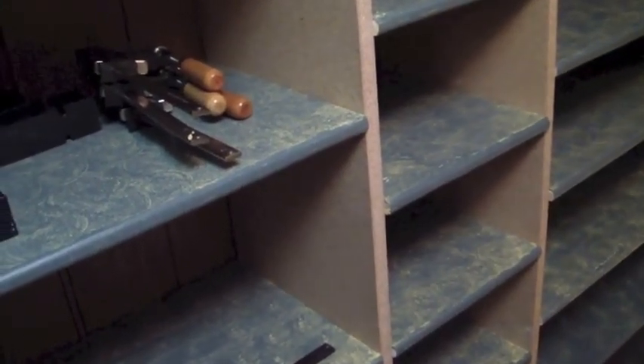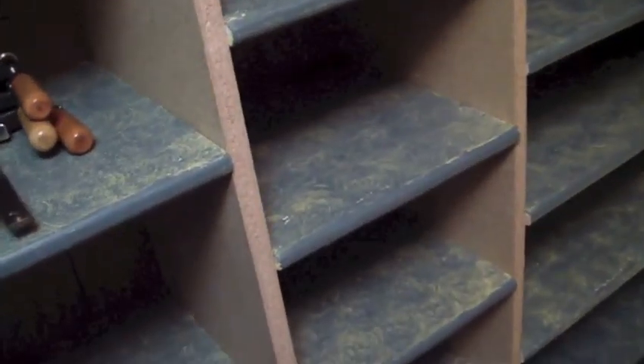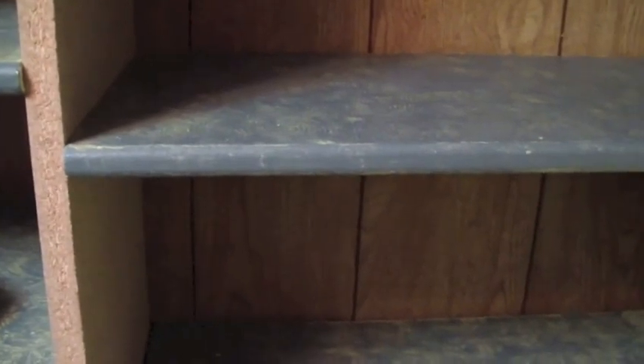Because I was alone it was just constant back and forth, but after a while I was smart enough to figure it out. I put in one screw in the back, leveled it front to back, screwed in the second screw, then put the level across and wherever it was leveled I raised or lowered that side and screwed it in. After I figured out what I was doing, I wasn't concerned about exact inches as much as I was about the level — that was my number one concern.